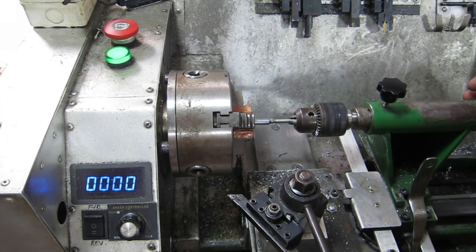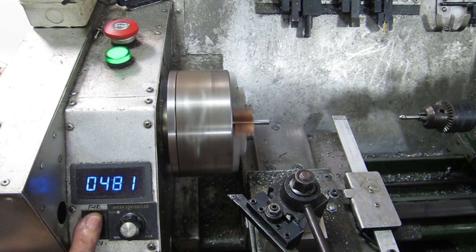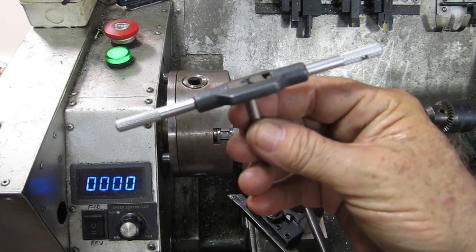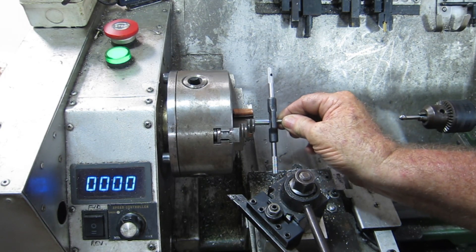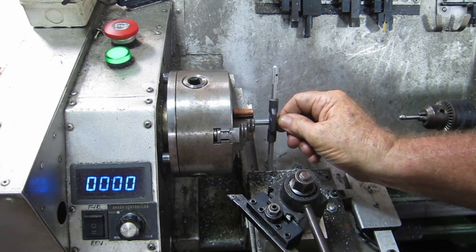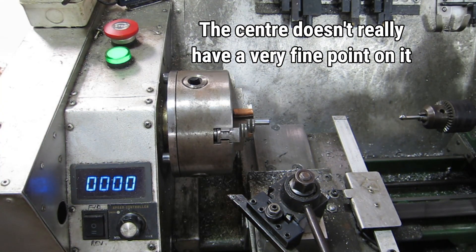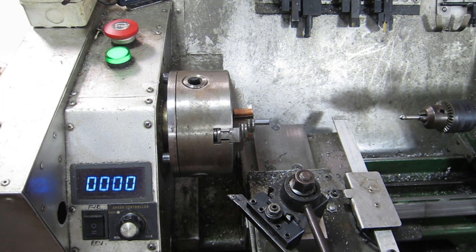This is a bit of 8mm stainless shaft. I'll try and put a little chamfer in there. This is my 3mm tap and that's the point I've got to work with, so I can't go too deep. It's not touching there at the moment so that's okay. And this is the 6mm - the biggest one I've got. This is the little handle I use quite often when I'm doing this. That's settled in there, that'll do me. I might put a tiny little drill up through the hole but this battery is about to go flat, so I'll do that and come back to you.